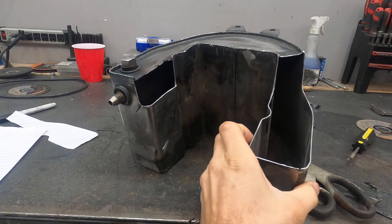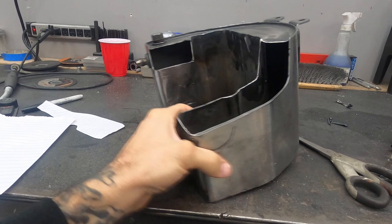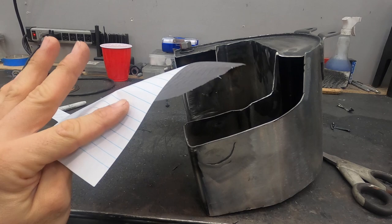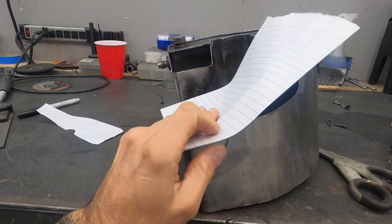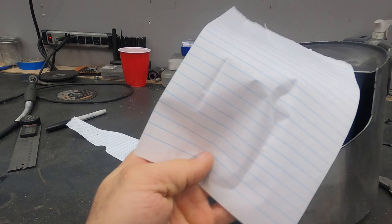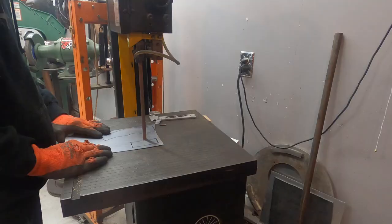Here's the oil tank — it's already getting that shape I'm going to want when I cap it in. I roughed everything a little more; here's the other side, you can see it needs to be filled. Making a quick template for this so I can cut it out, probably in 18-gauge sheet. Usually I use thick poster paper for templates, but this one is so thin you can literally press it in, pull it off, and cut right out. Here's what I ended up with — I'll transfer this over to a piece of 18-gauge and start cutting, then we'll work on fitting it back in.